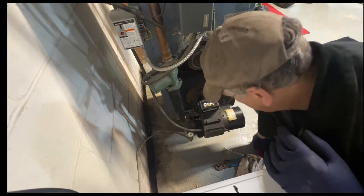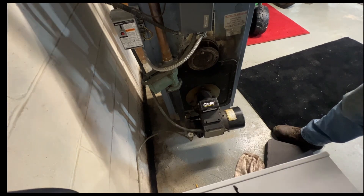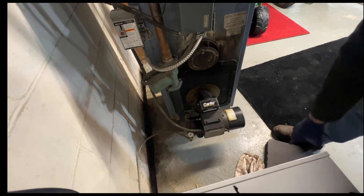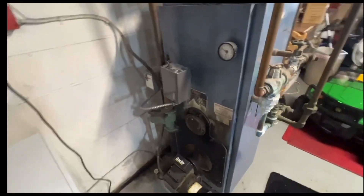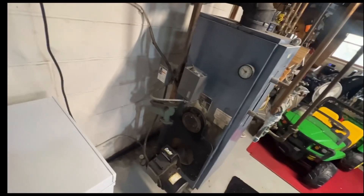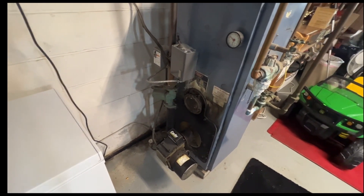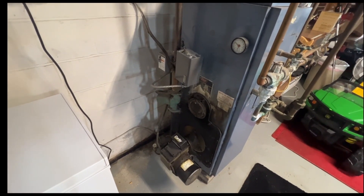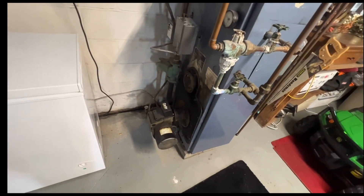I think that might have been shorted out in there — the electric on either the eye or on the bracket, because that was loose. I tightened that. Somebody was in there and wire-brushed the bus bars on the electrodes. I don't know — maybe I did it last time I serviced it, I don't remember. So I guess that's gonna do it for today. If you like the video, give it a thumbs up — helps with the algorithm, doesn't cost you anything. Thanks for watching, and if you wouldn't mind, hit the subscribe button and even share it if you've got somebody that's into burners.